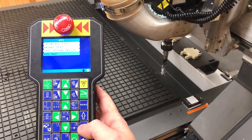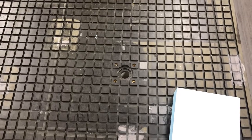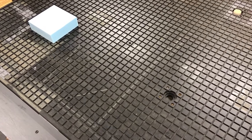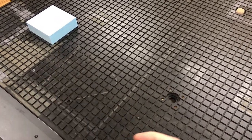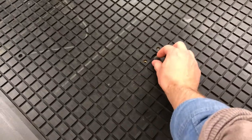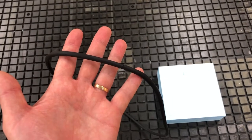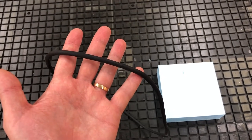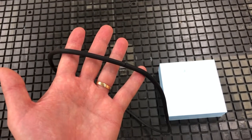Press cancel repeatedly to get back to the main interface. Plan where you intend to place the material on the machine bed. Any unutilized vacuum inlet within the same vacuum zone being used must be blocked — use a rubber or steel plug for those; the others can be blocked with MDF ones. Choose a vacuum sealing strip of adequate length and create a closed circuit with it.